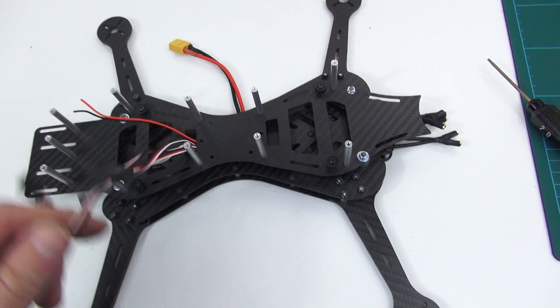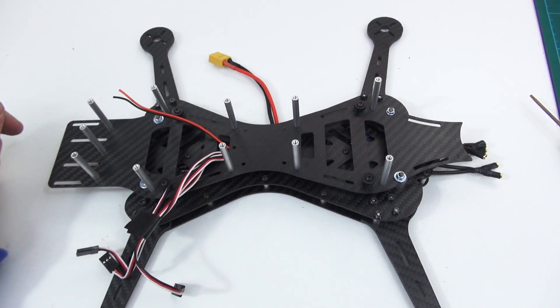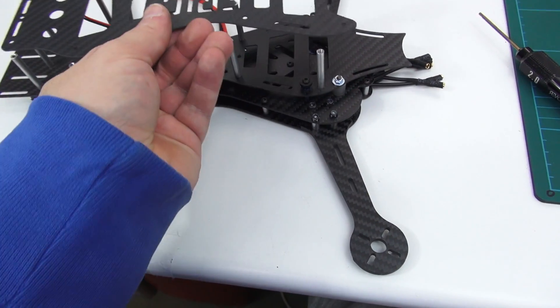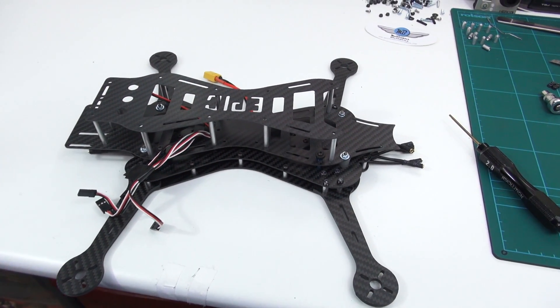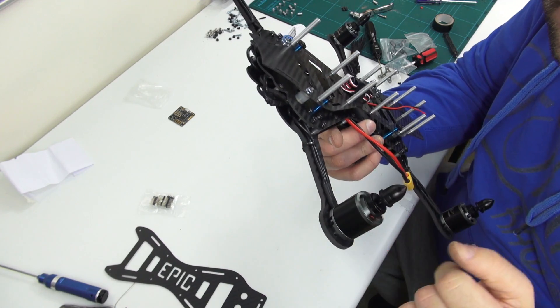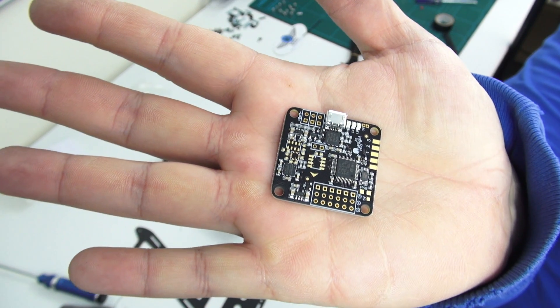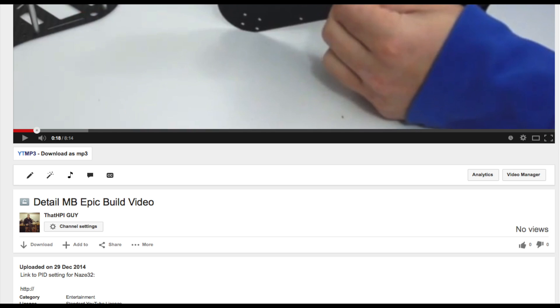As you can see, I've threaded the ESC cables through here, along with my extra power cable, and I have my battery cable just sticking out the side. All that's left to do is add the top plate on and that's the basic frame finished. But to completely finish this we need to add our flight controller and screw the motors onto the end of the arms. The flight controller of choice for this quadcopter is the Naze 32 — the one in particular that I have here is the acro version, but I'll be putting the PIDs down below in the description. So that's all for this detailed build video. Stay tuned as we'll be setting up the Naze 32 and going out for its maiden journey. Thanks for watching guys.